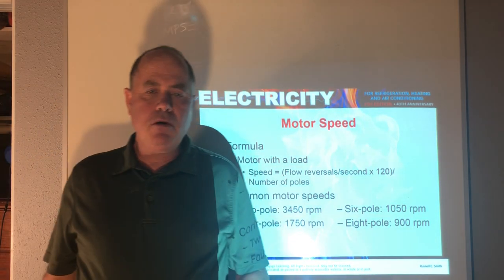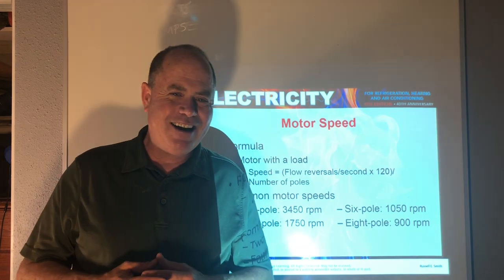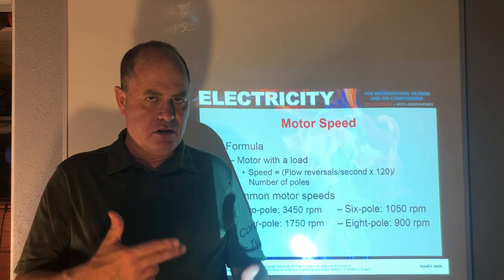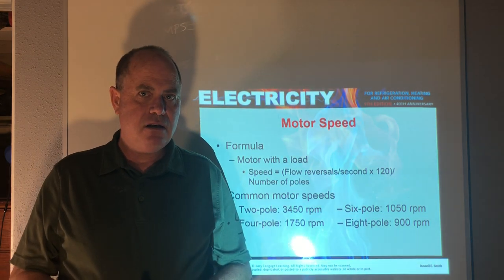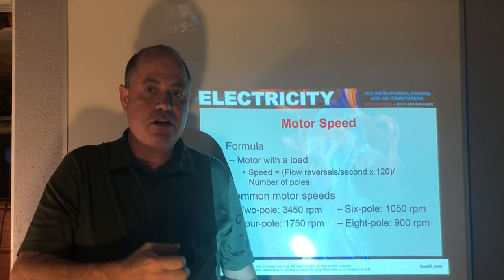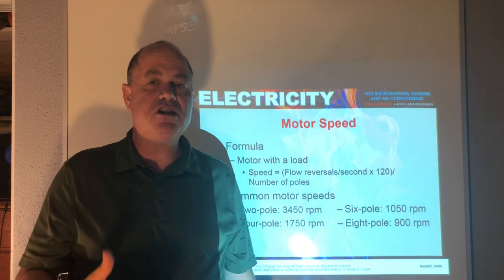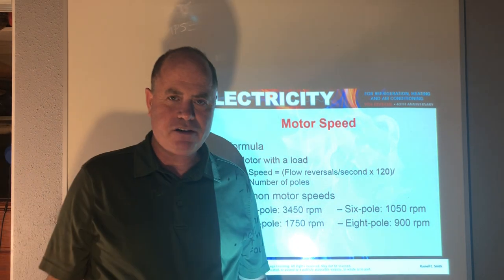So, two-pole motors, I'm not going to beat you up on the math right now. I'll wait till we're back in person and then I'll beat you up on the math. Two-pole motors run at around 3450 RPM. Mathematically, it's 3600 RPM, but there's a little slippage. It's not a perfect machine. So 3450, that would be my mini pincher. Very quick, but some little shaded pole motors, if I held it with a glove, it wouldn't be able to start and overcome my grip. But a 4 or 6-pole motor would break my wrist. Maybe it wouldn't go as fast, but it could break my wrist just like my Akita can. That's why I made a harness for when I walk it.